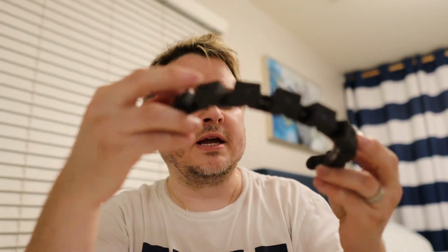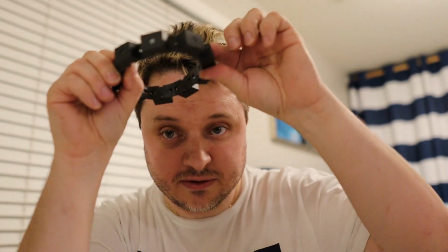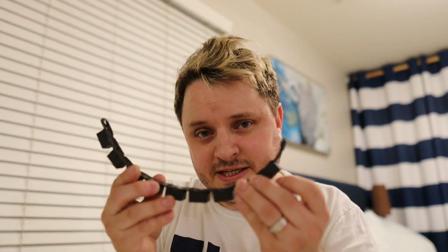The last part that you have to install for your garbage disposal is this magnetic ring. Sometimes this is a magnetic ring, sometimes it's just a magnet that will stick on the side of the garbage disposal, and you just wrap this around the drain underneath the sink, and you can do this after you have it already installed. The point of this is it stops metal objects from going down, all the way down into your garbage disposal and causing a problem. You definitely don't want any metal in there. So let's go ahead and slide this ring on, and then we'll finish up the job.